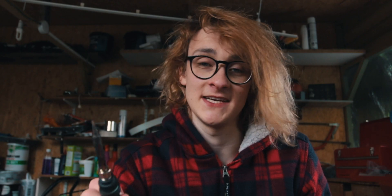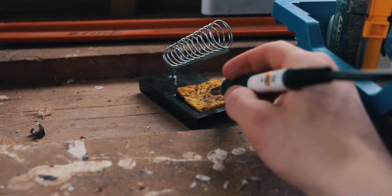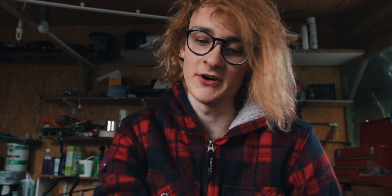So first of all, desoldering — how do you do it? Well, you'll need your soldering iron and your solder sucker. First of all, set your soldering iron to a medium to low heat and give it time to heat up. While we're waiting for that, I might as well introduce today's sponsor, which is Nobody — if you're interested in sponsoring, there's an email on my contact page. Now that it's up to heat, the first thing you want to do is clean the tip of your soldering iron. I'm using a sponge — you can also use those mesh things. I'm not the expert at soldering, but sponges definitely work.